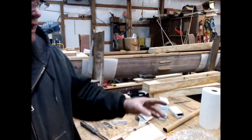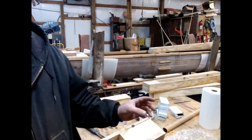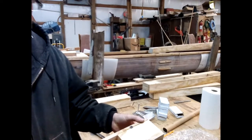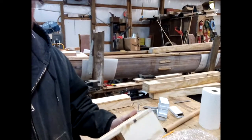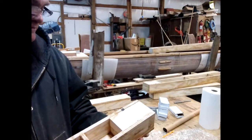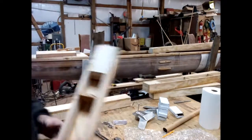There'll be 4 bolts. Then there'll be a hinge with a 5/8 shaft, 1/4-inch pin. So nice and thick. It'll be welded on with some stainless rod. It will be extraordinarily strong. And maybe I'm a little bit paranoid, but you know, paranoia has saved me a couple of times.